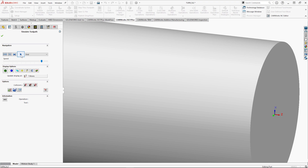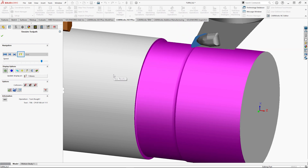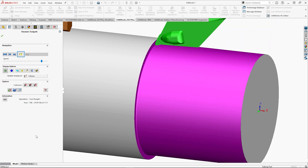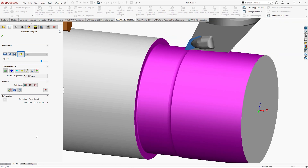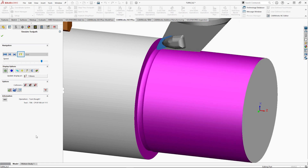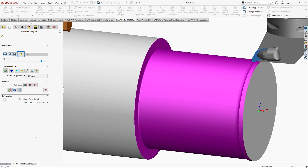As we can see the simulation play, we can see another key feature of prime turning. We can see that, in a way to reduce cutter forces, we actually turn in reverse to conventional turning. This is one of the ways, but not the only way, prime turning will allow you to get better feeds and speeds to make your machine quicker.